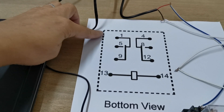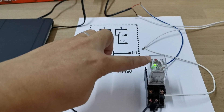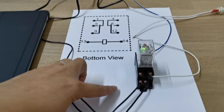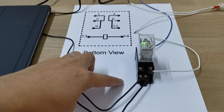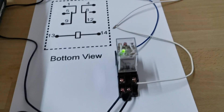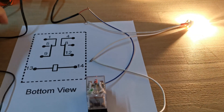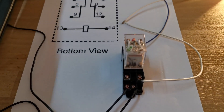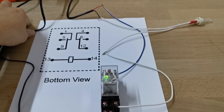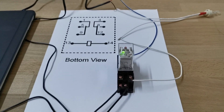To recap: terminals 1, 5, 9 work the same as terminals 4, 8, 12. Terminals 13 and 14 are the power input. Bear in mind this is a 24 volt DC relay, and the majority of fire alarm systems provide 24 volt DC output during any fire incident. When there is no power from the fire alarm, the EM lock is working fine. But when a fire incident occurs and the fire alarm triggers the relay, the EM lock will be released. That's all for today — if you have any questions, please leave a comment below.